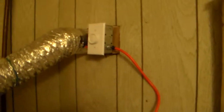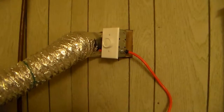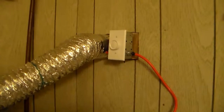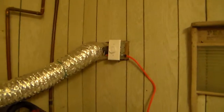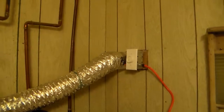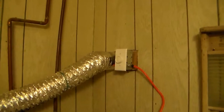It's been on for about three hours now with no problems, but I can feel the actual switch vibrating. So it may not be a good idea to use a light dimmer switch. It doesn't seem to be getting warm, but it does vibrate and it does buzz. I think I'll pick up a proper fan-rated one and swap it in when I get a chance. The lower you go, the higher the buzz.